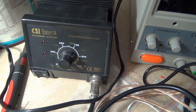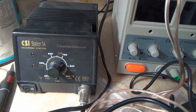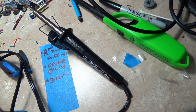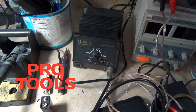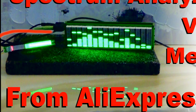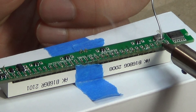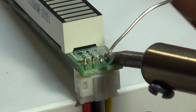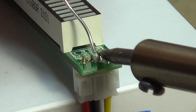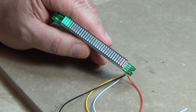Here's my fancy temperature-controlled feedback ceramic element soldering iron — separate base unit where you dial in the temperature and it stays there. And this here is a basic 30-watt iron — on full blast, and that's what you get. I already assembled the pro tools VU meter in a previous video, but just to prove the basic tools soldering iron can do the job too, here's some footage of soldering the LED board pins, soldering on the connector, and testing it out. Looks like it works.